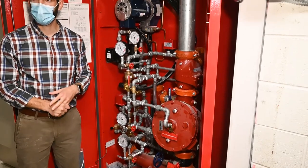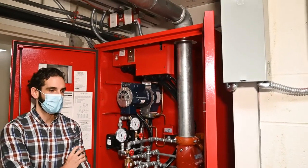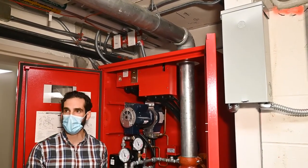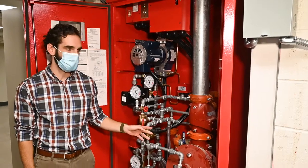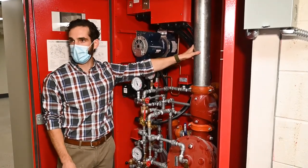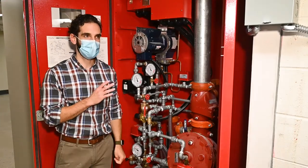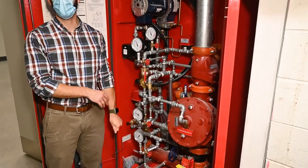Can we get notifications once the pre-action system is set off? Yes. As soon as the smoke detector goes off, that'll send your building into general alarm. It'll also tell the central monitoring location that it is the pre-action system, and it'll tell us when there's water flow. There's a water flow monitor in here. This system is pumped up with air regularly — that's how it's supervised. If the air pressure ever goes down, we'll get a switch that activates and tells us there's low pressure. It's monitored for trouble, for supervisory, and this will also shut the system off — so if that valve is ever closed, you'll get an alarm back at the panel.